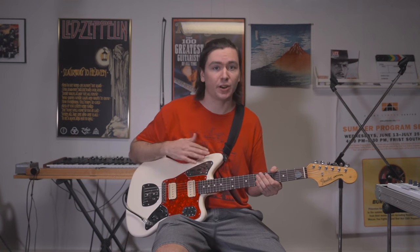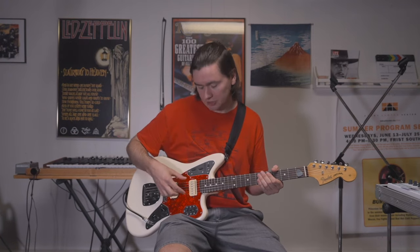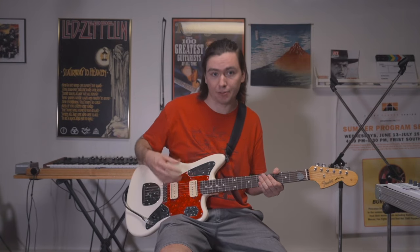The soldering work was fairly easy given the limited controls, and I didn't have to rewire the pickup selector area dramatically, just move a couple wires around. Upon doing some research online, I noticed that some folks installed their neck pickup reversed so that the rail coil, which is the more Fendery of the two, would be closer to the neck and therefore give it more of that classic bell-like chime of a Strat neck pickup. So I opted to do the same, but I left the rail coil on the inside for the bridge.